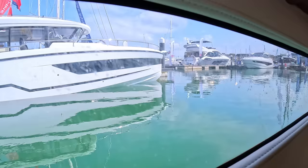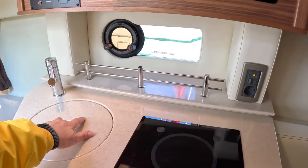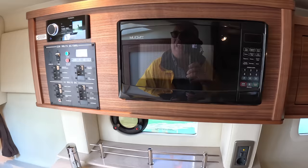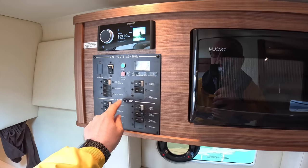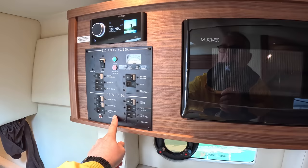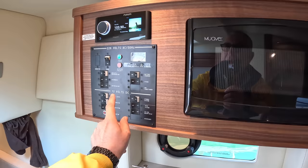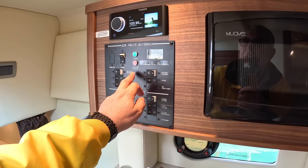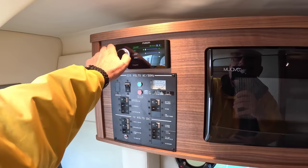Back here is the galley — it's electric cooking on this one, no gas. There's a sink and a microwave. There are switch panels here as well: 12-volt switching and 220-volt switching. The 220-volt covers things like the microwave, water heater, and battery charger — that's when you're plugged into shore power. The 12-volt is your ship's systems running off the batteries: cabin lights, fresh water pump, stereo, and the refrigerator. The fridge is dual voltage — when on shore power you run it off 220-volt, when unplugged you run it off 12-volt.